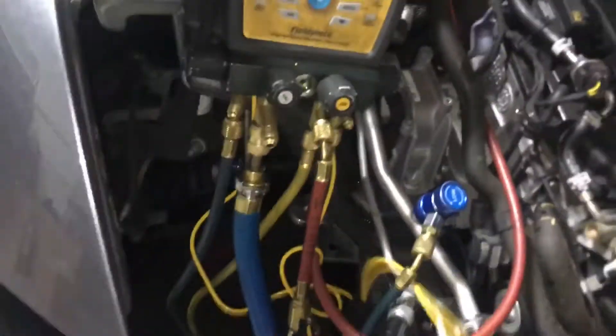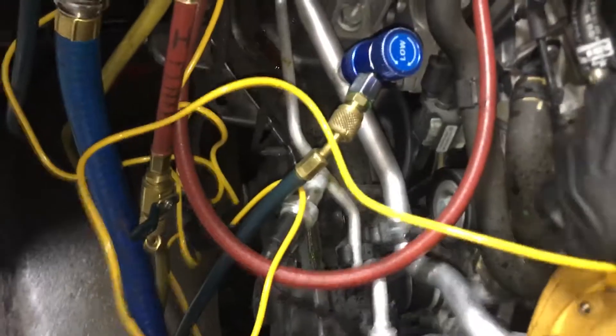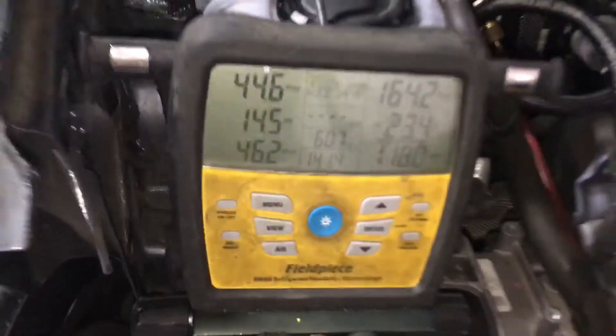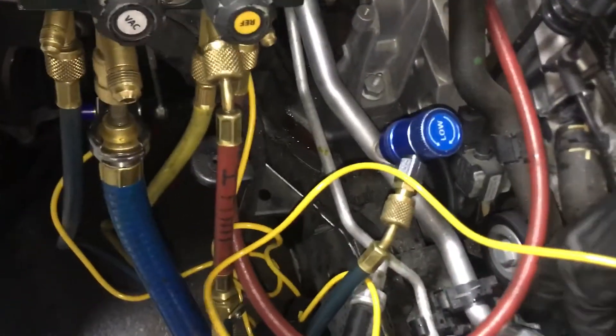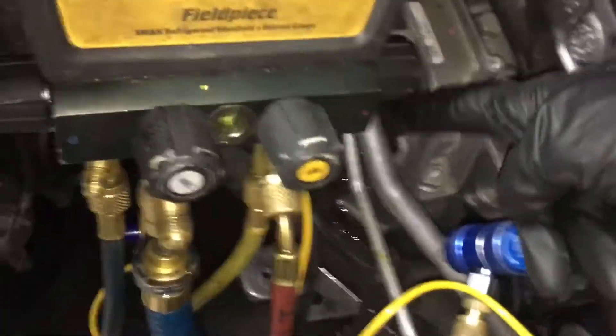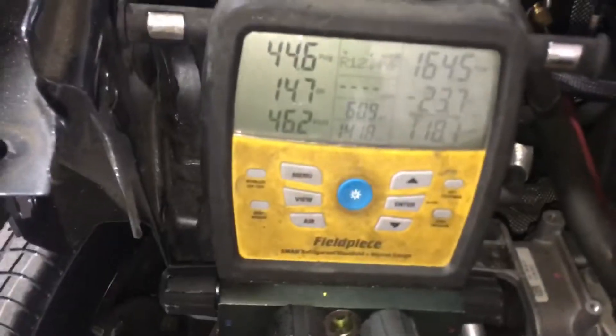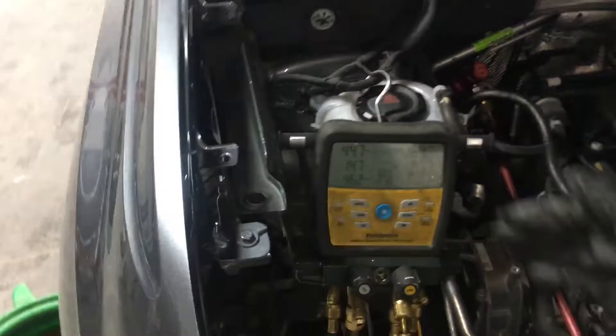Let's get the combined reading — what are we at combined? 60 degrees. We picked up a little heat; there's hot air blowing through here off the exhaust fan blowing on this metal, so we picked up a little heat. It's in a larger line — 60 degrees, and that's how your superheat goes up as you get towards the compressor.